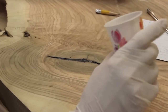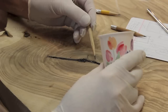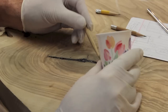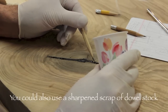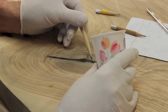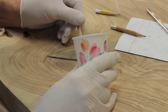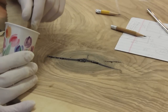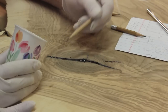So we've got this epoxy — don't want it to go to waste. Instead of trying to pour it in, I've got a couple of old pencils that are too short to use anymore, but they were long enough to get into the sharpener. A nice point on that makes it real easy to dab a drop at a time of the epoxy where I need it. I'm just covering up the areas that were low and the areas that had bubbles that I got rid of. These pencils work out just perfect for this. And the best part is, since they were too short to use anyway, when I'm done I'll just throw them away — no cleanup.